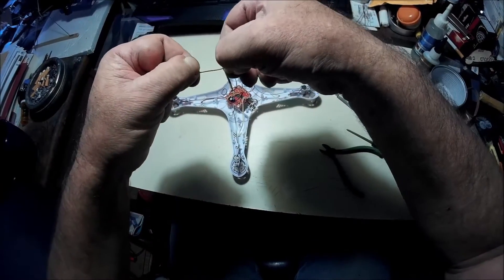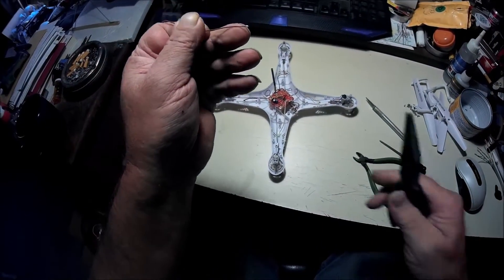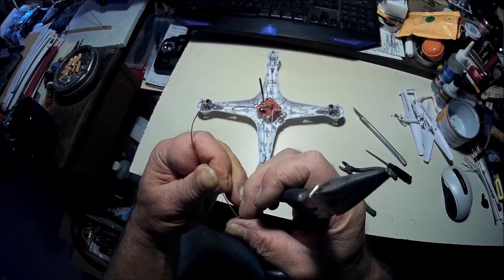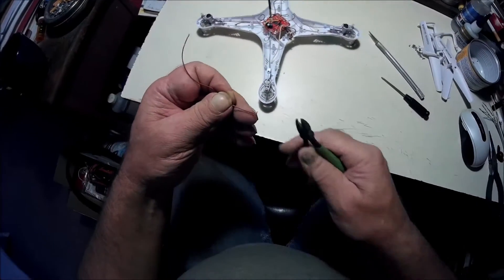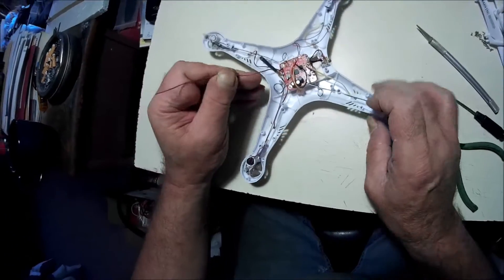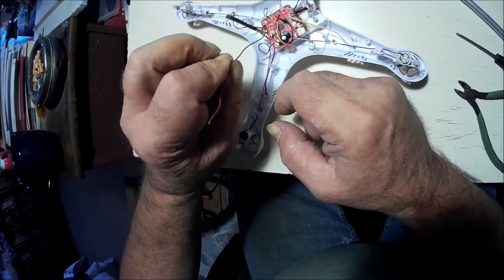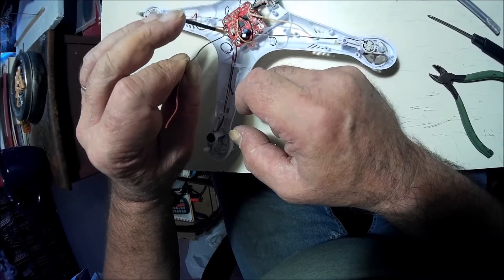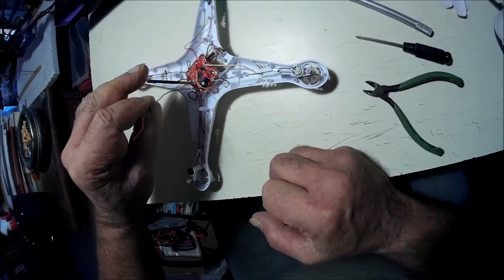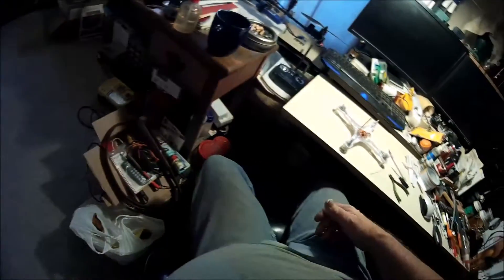Then I strip a little bit off the end - not very much, just enough to solder to - like that. This camera is not great for close-ups. You end up with a wire like that, and what I do is bend it over and make sure it's not too long, because all you've got to do is solder to that little bead of solder on your board. That's all you need to solder - just that tiny bit. There's a pad on the board and all you've got to do is put some solder on it, make sure it's a good solder joint, and then heat up your wire and solder and get it all soldered in place.